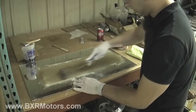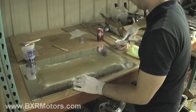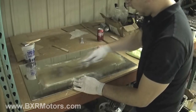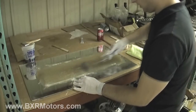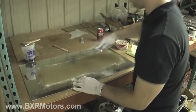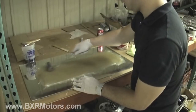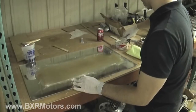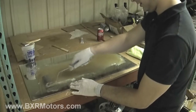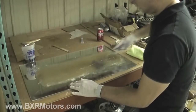This is real good for working out all of these air bubbles, and that's what the rollers do — they help evenly disperse the resin. If you have too much resin it can actually make it weaker. That's why things like vacuum forming are a lot better — they really get all the resin out and leave just the minimum amount for binding the materials together, which makes it really strong and really light.